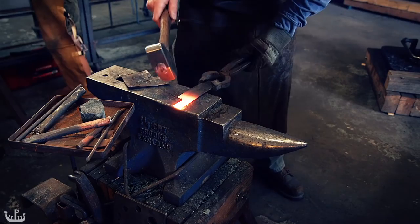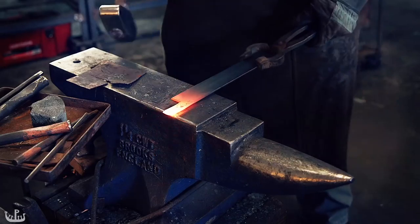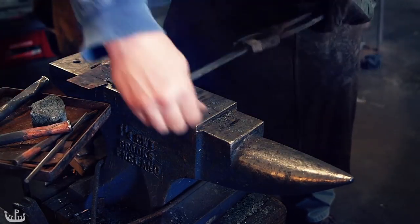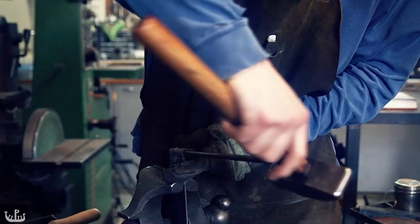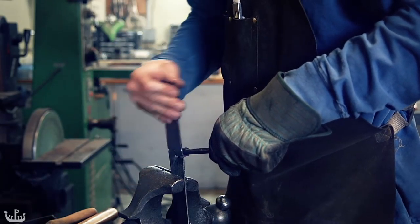I need to true up the piece and slightly taper it where the end is going to lie against the strap after bending it. After some filing, we are testing the barrel hinge. It is quite stiff, but that's easy to resolve.